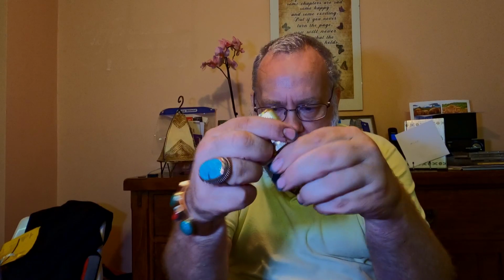So what I can do is on that side I can take one of these, and this is a 3/4 inch BSP connector, and it converts that into a hose lock connector. So now I've still got the quick release connector, but it's now secured firmly onto the pipe, with its own inline tap.